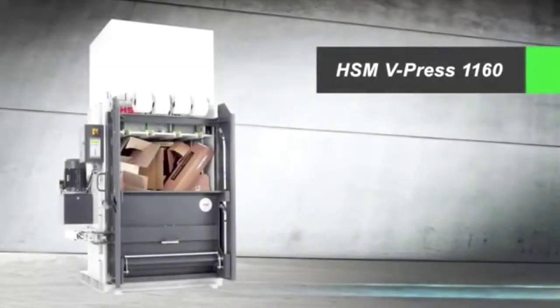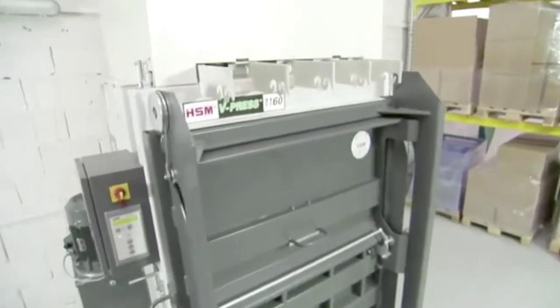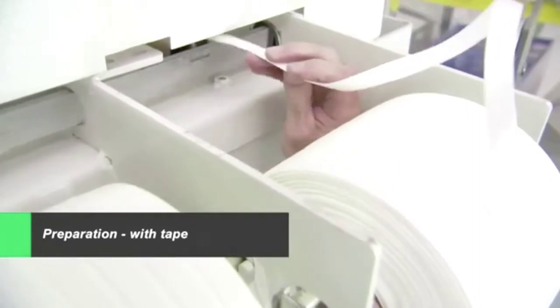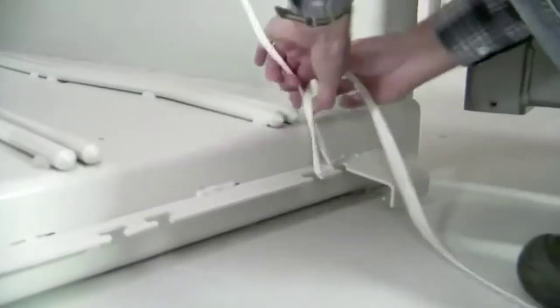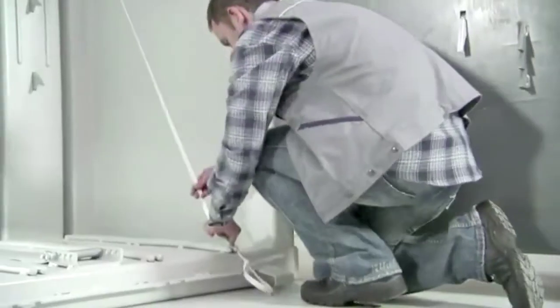In this normal version we have the bale injector with a belt, you see the belt on this machine. And in our special versions, for example the 860P or 860S, we have an injector with a metal chain, because we have very sharp material, like hard plastic for example, and it would destroy the belt, so we have changed it.